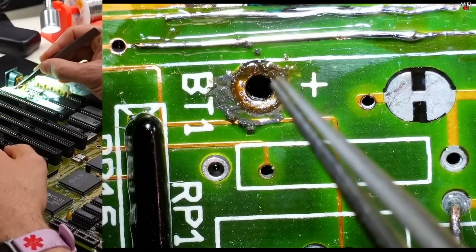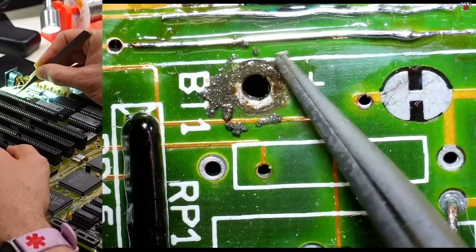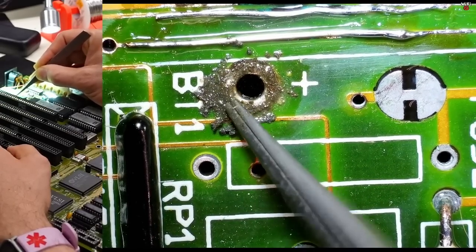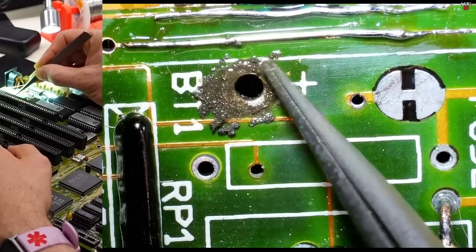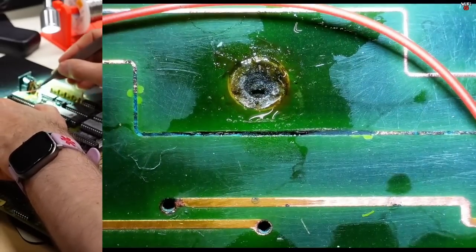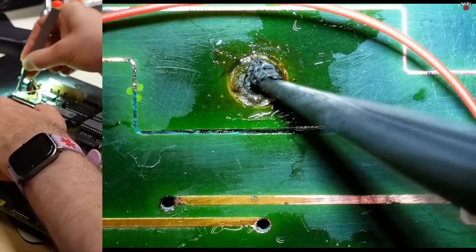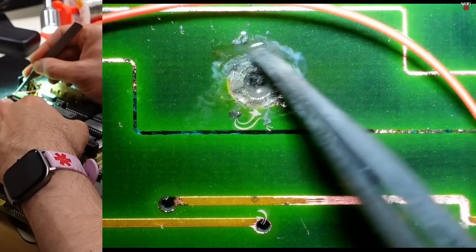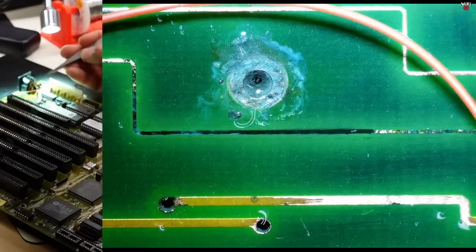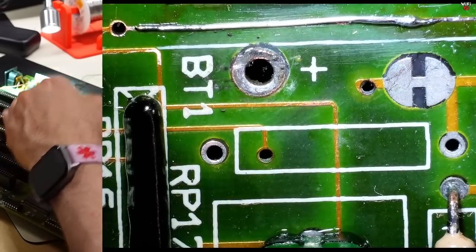The final thing I need to do before painting up the board is remove the battery terminals — it's always a little bit of a trick. The old solder was such a disaster I had to work off a magnifying glass. But I got it out. Look at this disgusting mess — this is what happens to the nice solder on this board when it gets eaten away by that NICAD battery juice. There's the terminal and up here is the other one. This one really took the brunt of the corrosion. Luckily, this one's just ground — if you're wanting to connect a new battery to the board, you can just put it on anywhere.